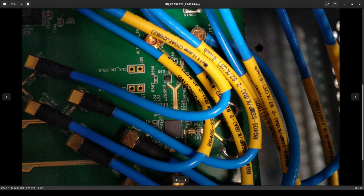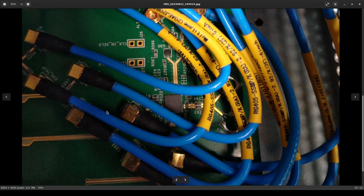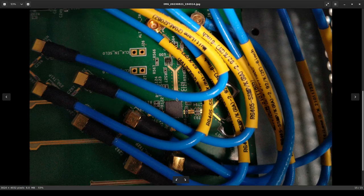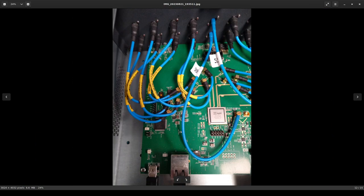Down below there's a mux for reference clock selection, taking the external reference clock from the front panel and the output of the main synthesizer. Test points allow selecting between the internal synthesizer and the external front panel reference clock. That's about all there is to the design — the main PHY chip, the microcontroller, power regulation, and a few muxes for clock selection. All of the fun happens in software.